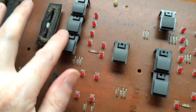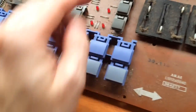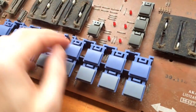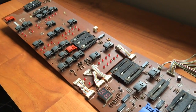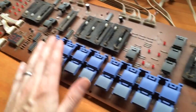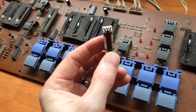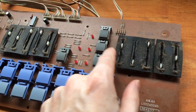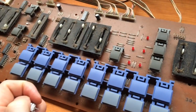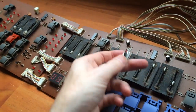Some of the switches are already clean, because I cleaned them before, but what we're going to have to do is strip the whole board pretty much. So the sliders have to come out anyway because we're replacing them. A lot of these switches underneath here were faulty, so all the switch caps will have to come off and the switches will come out. So we'll be left with a rather empty board after that, and I'll be able to wipe the dust off the top. Then once it's clean, I'll start modifying these sliders and I'll get them all ready, and then we'll place all the new sliders in. We'll reuse these dust covers because they're still sort of okay, and then put all the switches back on and the switch caps, and we should be done, and we can start testing exactly the alignment of the sliders.